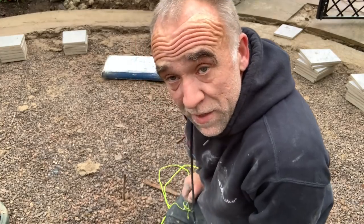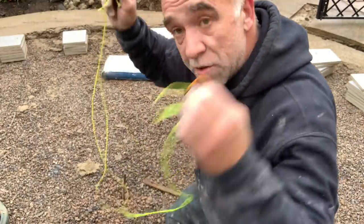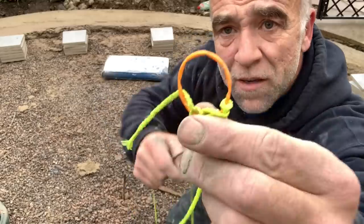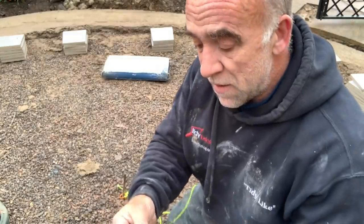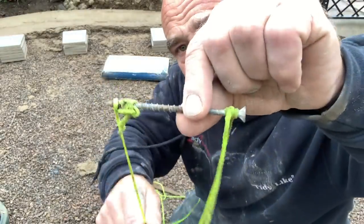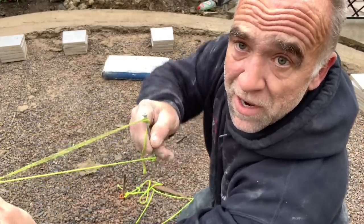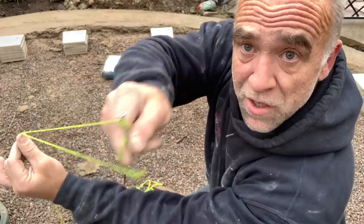Right, so I've taken away the shuttering. Now I've got my pin there on the floor. I just got to make sure it's circular. So I'll show you my little gadget I made up. Two pieces of string, one end with a bottle top on the end, just so when it goes on here, it can spin round and it doesn't get coiled round. Then the other end, I've got myself a screw, two pieces of string line. So when I pull it straight, it will actually keep the nail straight as well, because otherwise you could be going around angles like that and like that. So I've got two pieces of string on it, and that'll just keep it nice and straight.